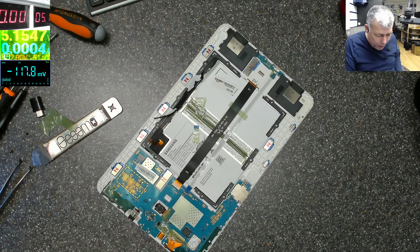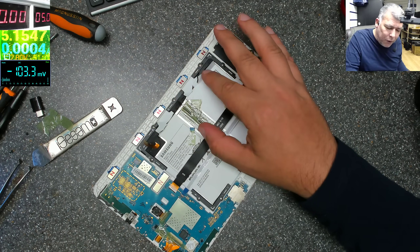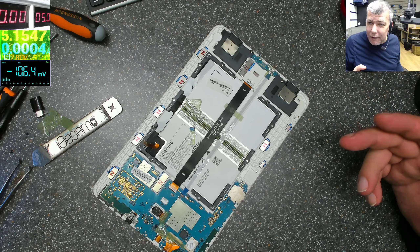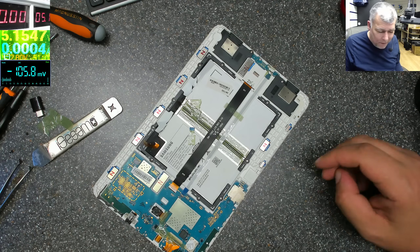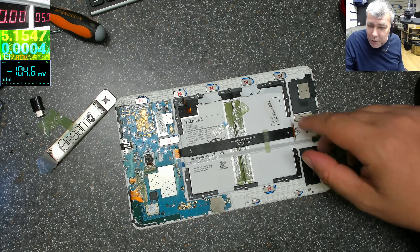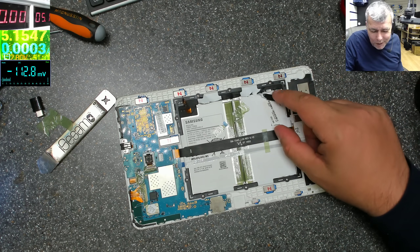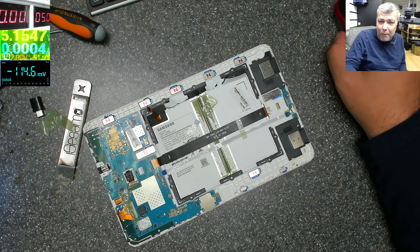Just to have an idea about this fault when you see this behavior — the problem is, to solder that back is extremely hard. I've seen some videos of people soldering aluminum under oil. It was interesting — I didn't know you can solder aluminum, but it has to be under oil so it can't oxidize. I will not do it on this one; I will order another battery. If you know a solution to solder those aluminum connections from the battery, please let me know — in a normal case you can't solder that. So thank you for watching, like and subscribe if you like the video, and see you on the next one. Bye.